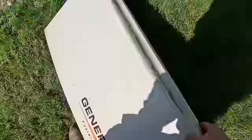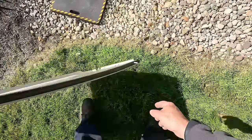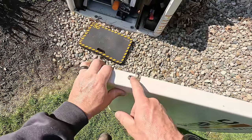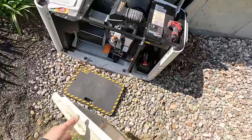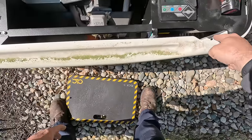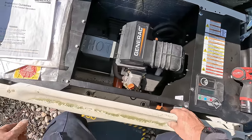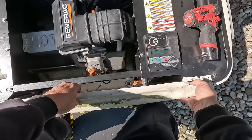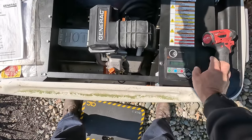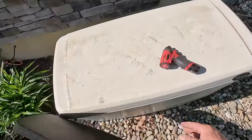I've explained a couple of times how to do this door. Several people don't understand it. You can see this pin right here that's partially bent — it's flimsy aluminum — and you have these flimsy little hooks. People bend the snot out of them all the time. The way I do it is I hook the bottom ones first, bring it up, those little hooks hit, then I put my knees gently against it, lift up just enough to pass those hooks, pop it in, pop it down. She's locked into place. We're on auto — the customer did not lock it before.